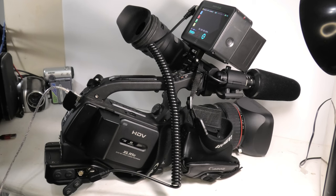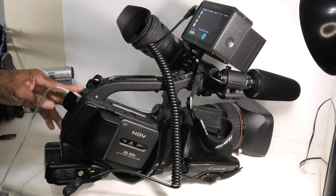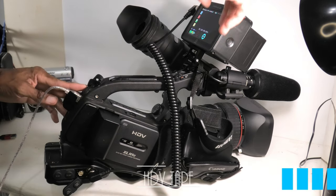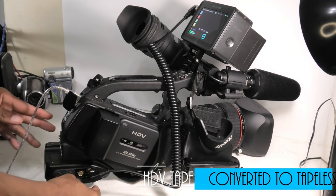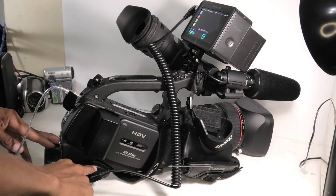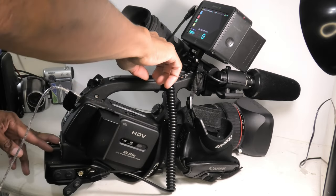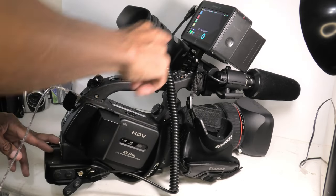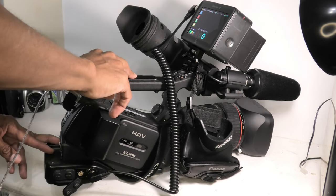Hey guys, welcome back. I'm here once again with my Canon XL-H1s. I showed you in a previous video how I could make it tapeless with this Samurai Blade digital recorder. It gets the output directly from the camera, bypassing all of the internal compression, putting the uncompressed digital video signal into the Samurai Blade where I can record it in Apple ProRes.